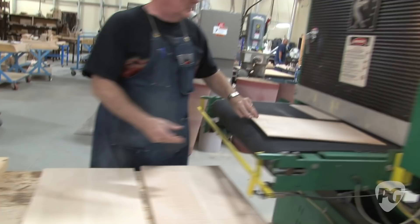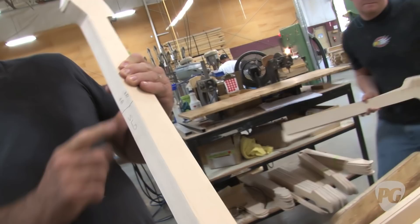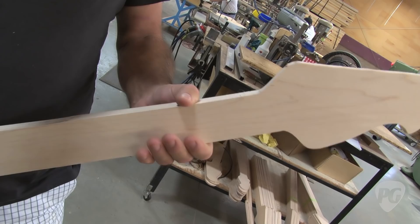Sanding some tops. The guy at our factory that does the bookmatching is unbelievable. Cheap guitar maker trick — you want to see what it looks finished? We start with a piece of maple that's the same piece of wood as the front board. We mark it — 38-38 for example — and we band saw it off. Then we route for the truss rod, put the truss rod back on, glue this back on, and it's the same piece of wood. And that's why with the Music Man, you can't see the seam. The reason is it's not a separate piece of wood for the fretboard — it's off the same piece of lumber we bought, starting oversized.